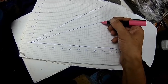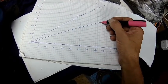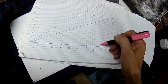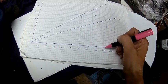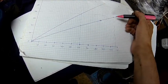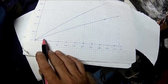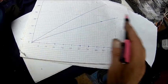And at 87 Hertz we're roughly at 320 volts — we've got much more voltage available — that's the reason why we can go higher in speed without loss of torque. And that's the problem: if you run a motor very slow, you're running out of torque at the bottom end.